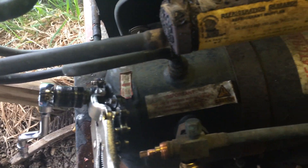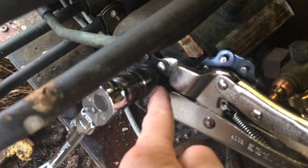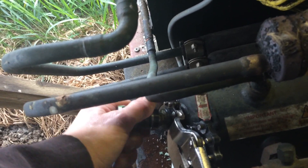I don't think that plug was going to come out easily. They mount these receivers — they just sit them on the base with a really thin steel strap and one bolt, going into a keyway down there. There are no mounting feet; it's not solidly mounted. It just sits there, so when you go to turn this the whole thing wants to spin or twist. I've got a chain wrench around the boss here to get something to work against. It did feel like the brass was twisting to start with — that's something I'm always a bit wary of with these.